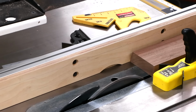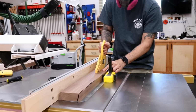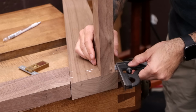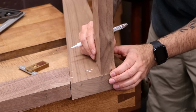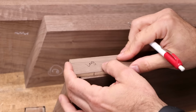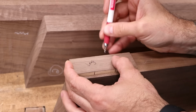By the way, this is why the short aprons were initially cut wider than the long aprons. The bevel cuts reduce the width. With a center line drawn on the apron and the apron set back with the 1/4-inch reveal, I can transfer the center line to the leg. That's the line that I need for setting the fence on the domino. The other lines will come from 2 little layout guides that I made. One for the legs and one for the aprons.